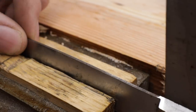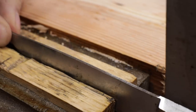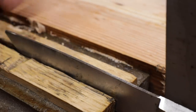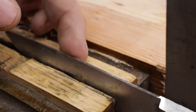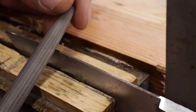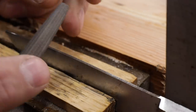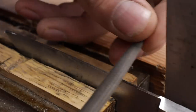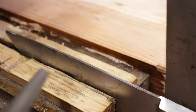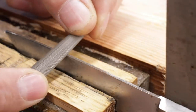The best way I've found is to take your scissors and clamp them in your vice. If you have a woodworking vice, clamp them right in there. If you have a machine vice, just make sure you have some soft jaws so you don't mar the edge. Put your scissors in with the flat side away from you. If the scissors are in pretty rough shape and have some burrs or nicks, get yourself a small fine file — a saw filer's file works very good. Start at the back — you can see this is all rusty — and pull back.